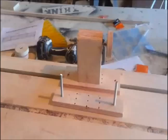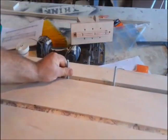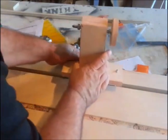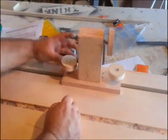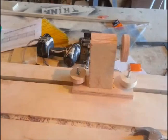For my tailstock I have this two-inch plate that goes up underneath and rides in between those slots we put in earlier. Then the tailstock sits down on these — and then the two pass-through knobs we put together go on here. That locks the tailstock in place — it's not going anywhere. And this is the tailstock point that goes on here; our piece will sit in here and we'll make different style headstocks for different functions.